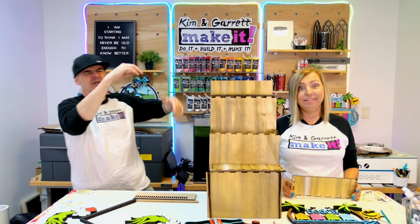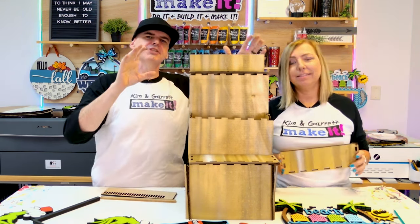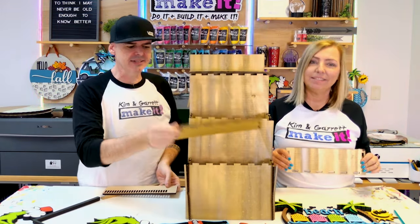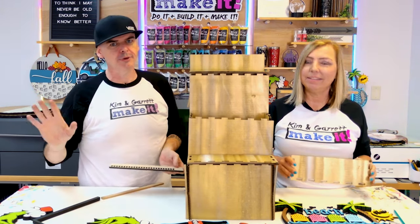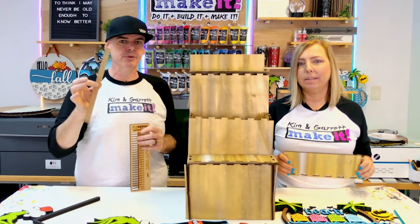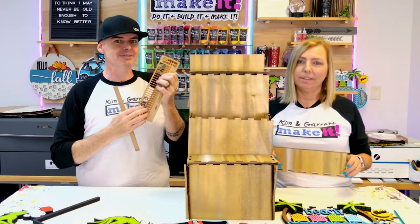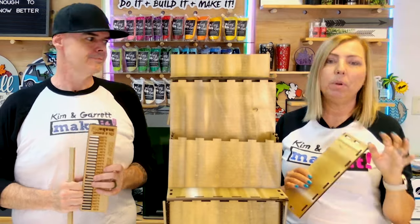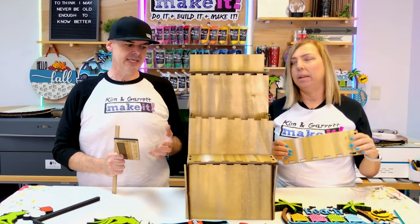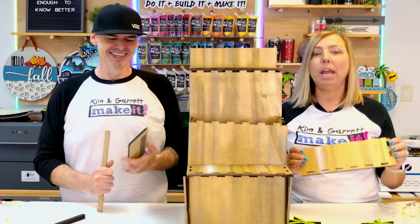It's time to make all of our cuts. I've adjusted the front shelf and the slots that were too deep, and I have a backer to make it a little more robust. None of these slots and tabs fit with the cardboard because I didn't know the thickness. Now it's time to get our actual slot thickness. I've measured this MDF with our calipers and it's 0.25 flat. But I don't think I want my slots to be 0.25 — that's going to be super tight. While we want it to be snug, we don't want it so difficult to pull apart that it's going to squeak or break when you assemble it. And then we're going to add a coat of paint.